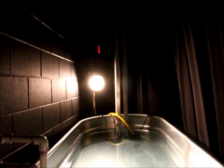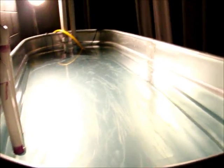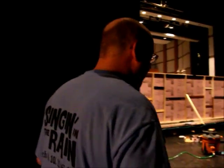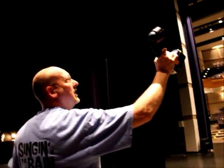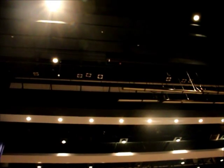Once we hit the catwalks, I reduce it down to a one-inch pipe that runs through the catwalks over to our sprinkler heads, our delivery heads. Let's imagine we're following the water up through the catwalks to our sprinkler heads which are right up there. Now if these look familiar, that's because these are rain gutters — vinyl rain gutters turned upside down.